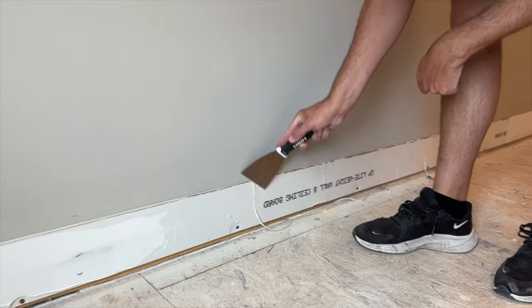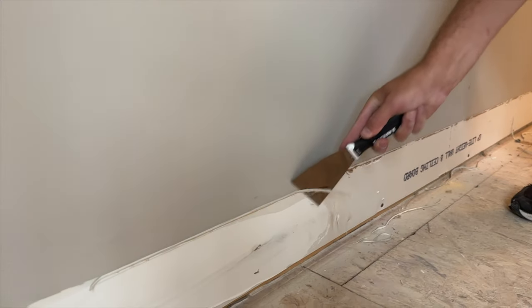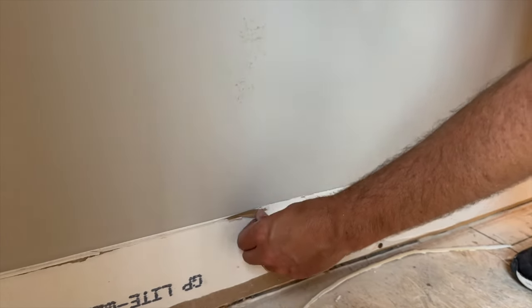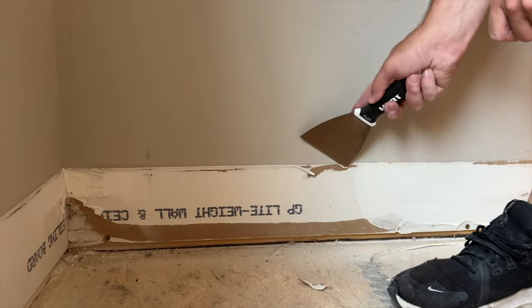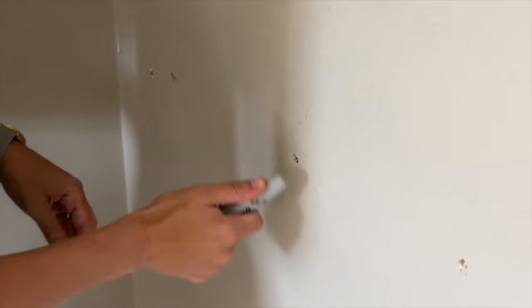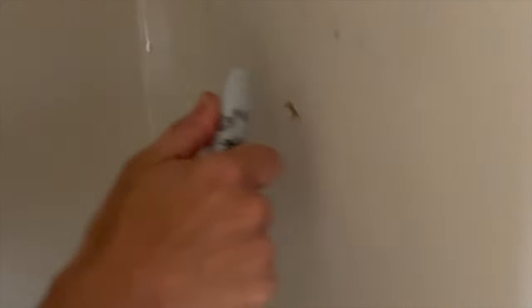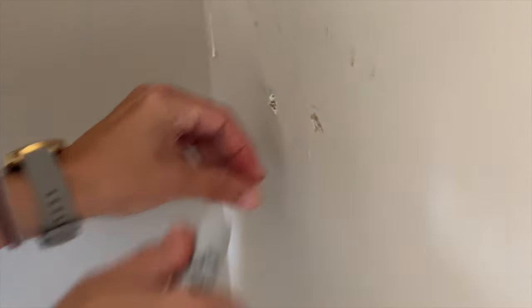I like to take a flat scraper and remove some of the excess caulking left on the wall. Be sure to do this in a downward manner so that if the paint tears, it tears downward and not up into the wall that will be exposed later. Also, something that will definitely prevent a smooth finish when patching these holes is drywall paper sticking out. You need to trim that back as nicely as you can, then use the end of a Sharpie to push it in and round it so the drywall mud can patch over something smooth. We've done all of the prep — the floor is prepped — and the next stage is to mud the drywall.